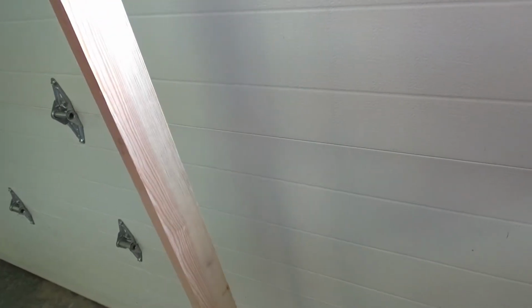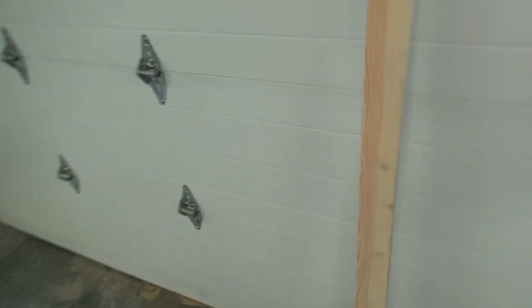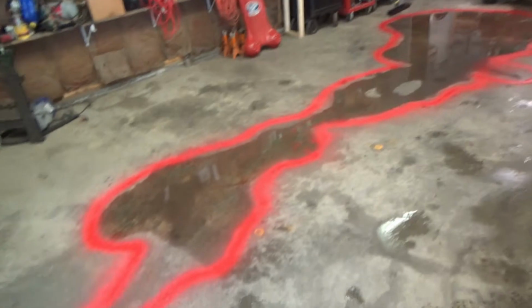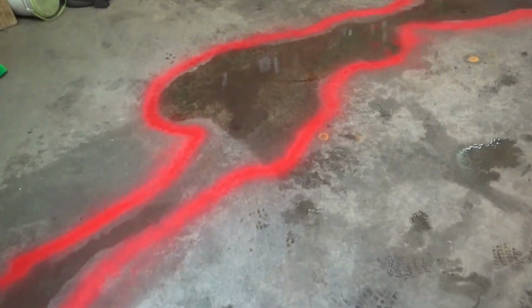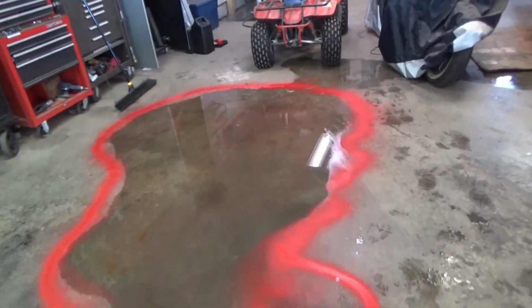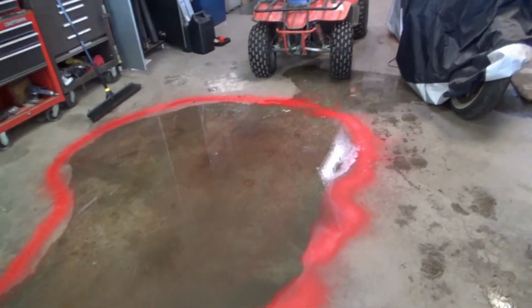And I picked up a finished 1x3. The reason I picked a finished board, and check them whenever you do get them, is to make sure it is as straight and flat as absolutely possible. And that is what I'm going to screed with. I thought about buying an aluminum screed, but it gets like over 6 feet, which is nuts. But hey, what are you going to do?